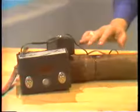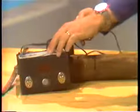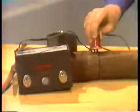One inspection procedure that may require a special tool is detecting tube thinning. Now, sometimes tube thinning can be determined simply by looking at or touching the tubes. You might feel a gouge or depression. Some thinning, though, is harder to detect and can only be determined by an ultrasonic measuring device. Now, an ultrasonic measuring device uses a high-frequency sound beam to measure the actual thickness of the tube. The measurement can then be compared to the minimum allowable wall thickness to determine if repairs are necessary.